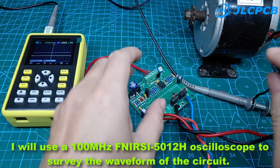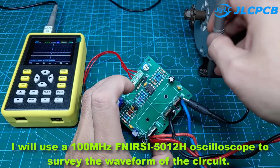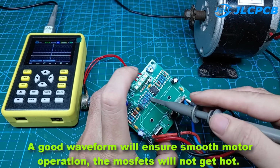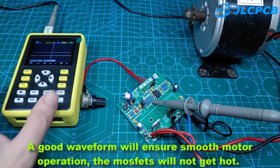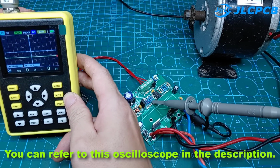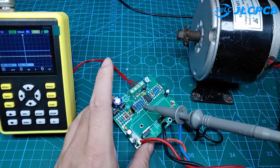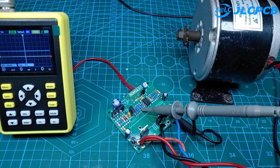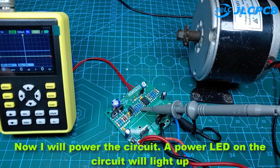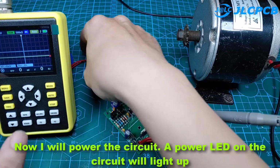I will use a 100 MHz FNIRSI 5012H oscilloscope to survey the waveform of the circuit. A good waveform will ensure smooth motor operation, and the MOSFETs will not get hot. You can refer to this oscilloscope in the description. Now I will power the circuit. A power LED on the circuit will light up.